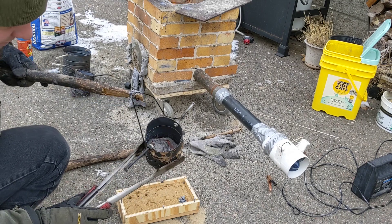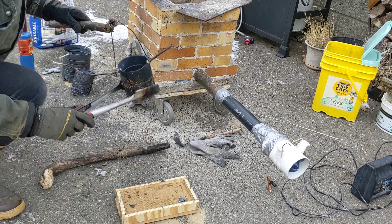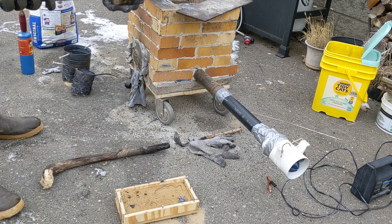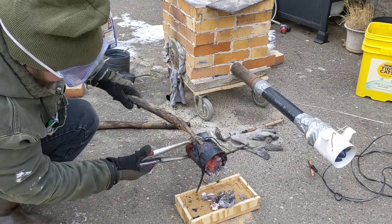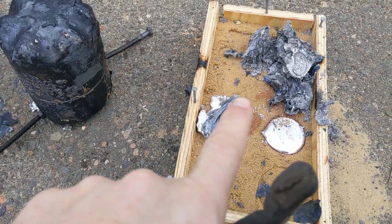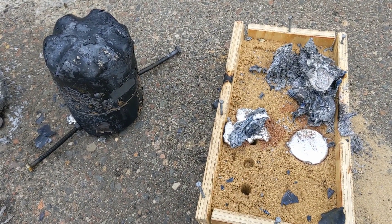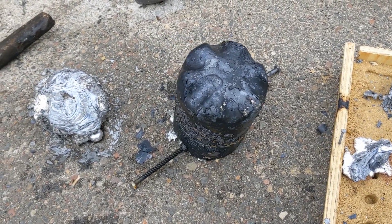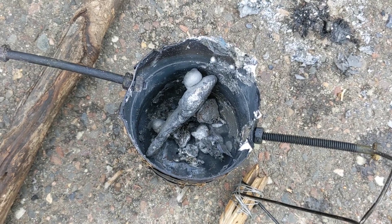We've still just got kind of an aluminum slag pancake in there — there's really no molten metal in this. This metal does not want to pour; it just turns into metal fluff when I try to move it. So I've thrown a bunch more cans in there and some aluminum foil and I'm going to try to pour it again. That went pretty poorly again. I did get one thing poured into my form and then a bunch of gunk came out and the slag has a bunch of aluminum mixed in with it. I don't really know what's going on — I don't know if this is too hot or not hot enough, though it's definitely hot enough to melt and deform my crucible. So let's try the other method — I've gathered up a bunch of the more pure blobs of aluminum from my failed attempts and I'm going to try to melt those down.